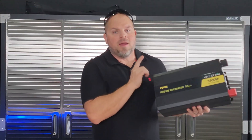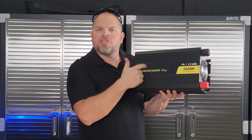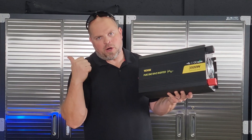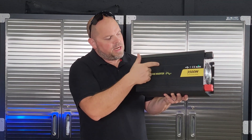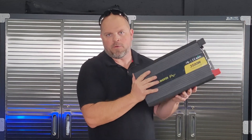Let me pause for just a second — I didn't show in the video that I had to change out my inverter to the 3,500-watt inverter to test that 300 amps for five seconds to see if the BMS would shut down. I had to switch it out because my other inverter wasn't strong enough to support that 300-amp test. I did switch it out during the process to confirm the BMS shut down at 300 amps — and it did. I just want to let you know that I used a different inverter for that.